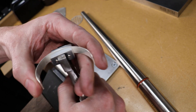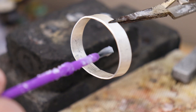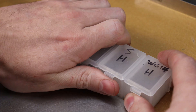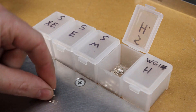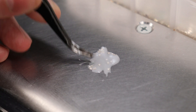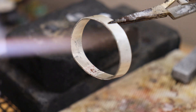If you're doing this like I am, just make sure you don't get any sharp bends in your metal and you should be fine. You need to connect both ends so we can solder them together. For soldering, I'm just going to use some handy flux on the joint and heat it up so I can place my solder. I'm going to be using some hard silver solder with flux on it — it seems to work a lot better like this and kind of sticks to your piece because everything's hot. Once everything's placed, go ahead and heat it up and make sure it stays on the actual solder joint. Use a solder pick if needed to move everything back.